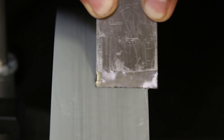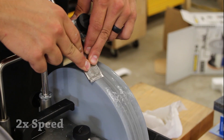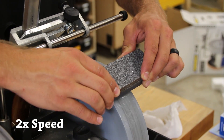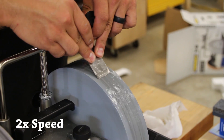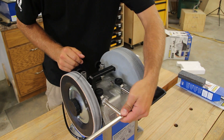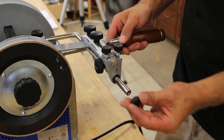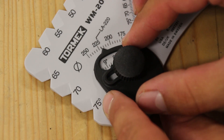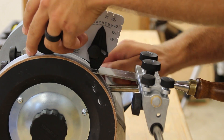The water from the trough will keep the grindstone and chisel cool, preventing overheating and ruining the temper. When you have completed the entire bevel, redress the stone with the fine side of the dressing stone with moderate pressure. We can then spend a little more time on the grindstone before heading over to the honing wheel. Remove the straight edge jig and tool rest and move them both to the other mounting holes — you'll need to flip the unit around. Just like before, install the jig on the tool rest, and because the honing wheel is smaller than the grindstone, we need to reset the wheel size on the angle master. Adjust the tool rest with the adjustment screw to dial in the correct angle.